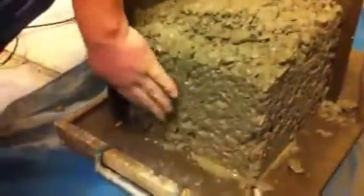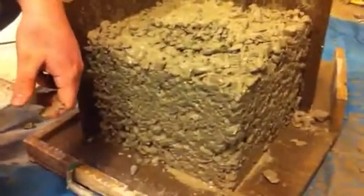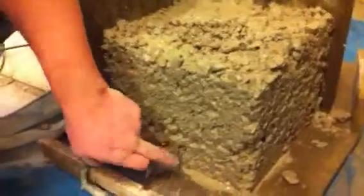There's not very much sand — it's very bony. It's just literally your sand does not have enough fines. It will not give the concrete enough mortar property to really vibrate. You can look at all the sides — it just will never happen, no matter how much water reducer we put in.